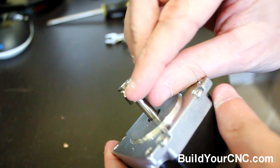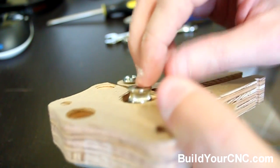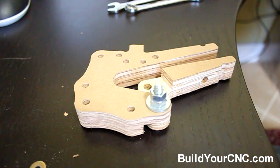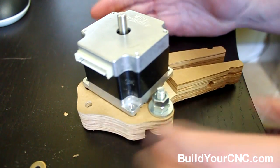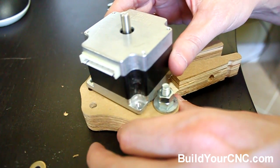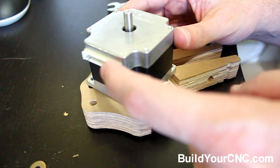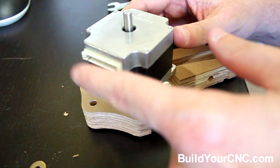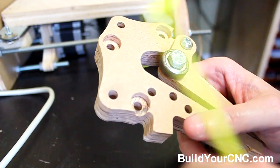Before you put this serrated hub onto the shaft of the motor, we'll want to put the motor into its place first, and then add the serrated hub to the motor so we can determine at what depth we need to install this device. The stepping motor will be aligned on this part and oriented in this way — this will be at the top of the machine on this side, so you'll want the connector to be near the top so it can connect directly to the stepping motor driver.